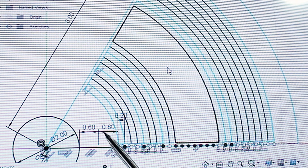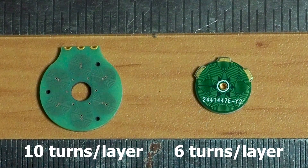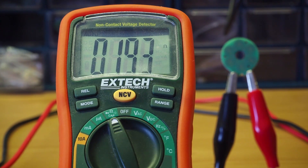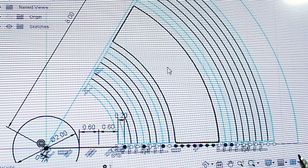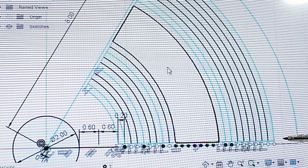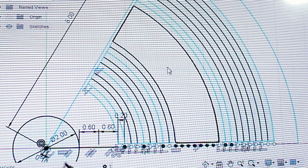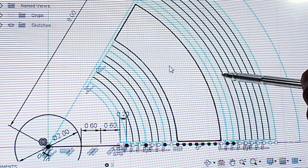In this 60-degree slice we need to fit one coil. From my experience I suggest making around 36 to 40 turns to reach a phase resistance of around 20 ohms. So far I have made 10 traces on this side and 10 on the other side. I also made a tunnel clearance here to separate the coils. This circle represents the hole for the shaft, and this extra space is to pass the traces and connect the coils. Now let's continue forming this coil.